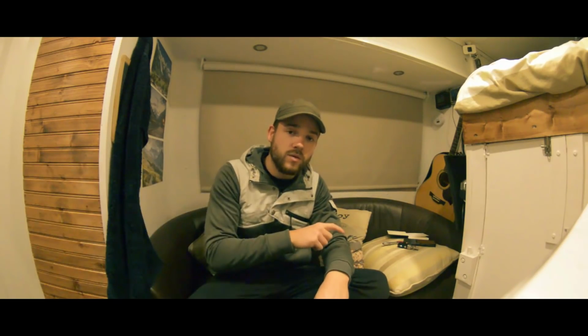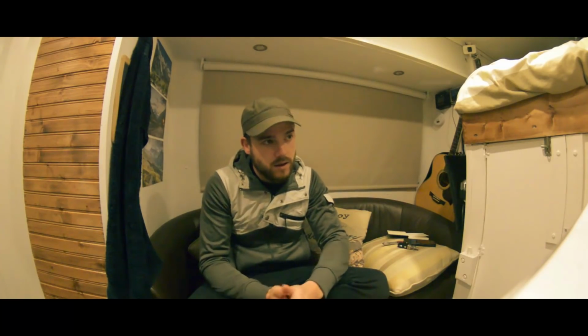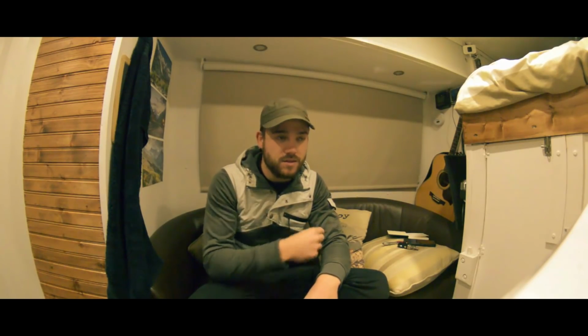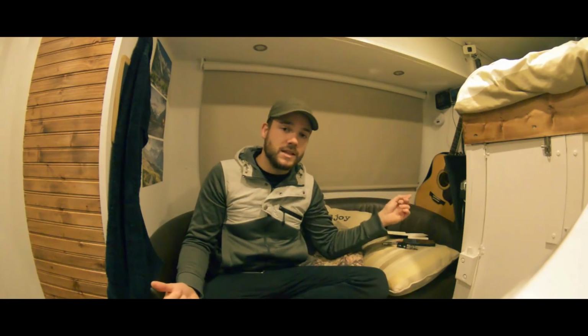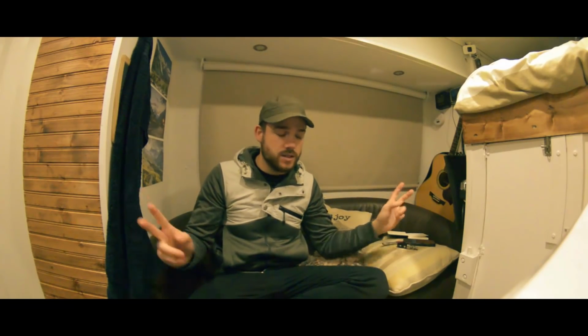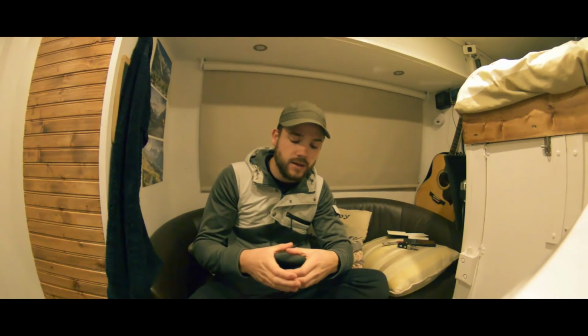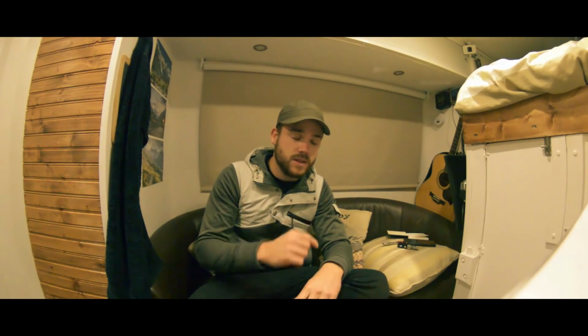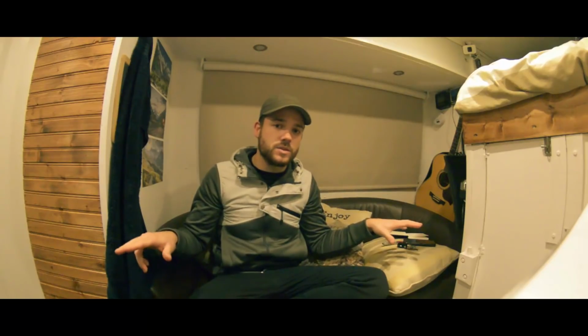I've put that all around the cable as well, and then secured it to the chassis under the van, just in case, so you won't want anything chipping up and clipping the sleeve on the cable and then that earthing itself onto the van, because that'd be a bad day. Obviously it's fused in the front and it's fused in the back, so 2 fuses, one on each side, to protect the controller itself. It's a little unit in there, and it's a voltage sensitive one. That's what I bought, so it knows how much voltage is in each.